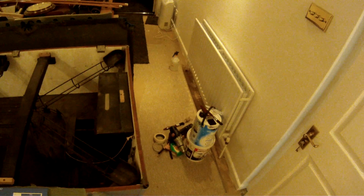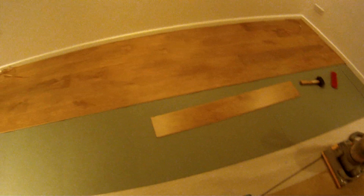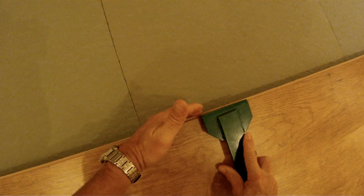So that's the basics of laminate flooring — continue all the way over. It gets a little bit tricky as you get to corners, but you just have to mark and cut. You don't go all the way to the wall because you've got the expansion joint, so that makes it a little bit easier to get those final bits of board in. When it comes to the other edge, the other tool you will need is one of these — go for the slightly more expensive, more solid pieces of iron rather than flimsy pieces of bent metal. This is a very nice one, nice bit of solid iron, which you use when it comes to that last piece of board over against the wall.